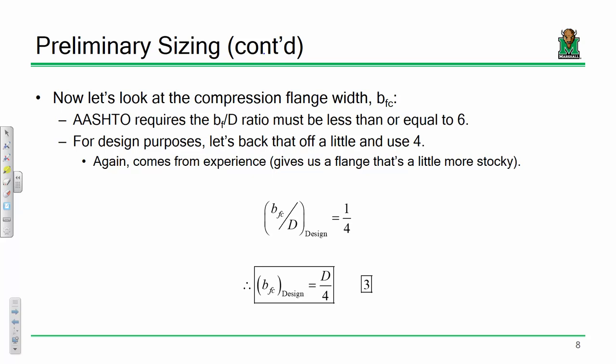Nowadays, we would elect to use, I mean, let's be clear, the stiffeners are meant to increase the shear strength of a girder, okay? Now, it might have been a while from steel design, and I know we covered it at the very end, but the shear in a girder is carried primarily by the web. The flanges are what primarily carry the moment, right? Nowadays, if I had a decision, do I use 8 stiffeners and a thin web, or 2 stiffeners and a little bit of a thicker web? I'm going to go with thicker web, because that's less cutting and less welding, okay?